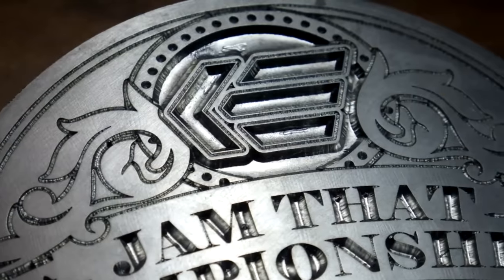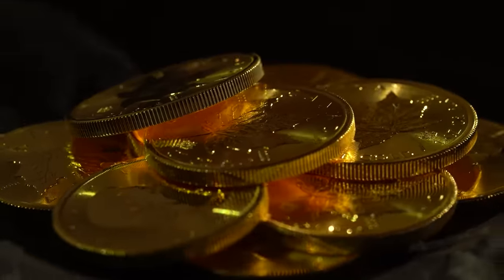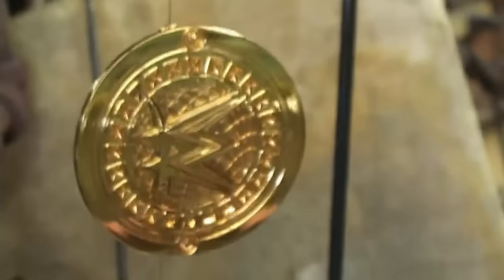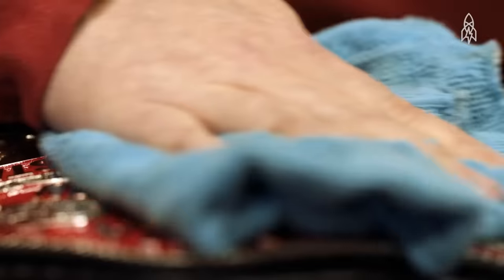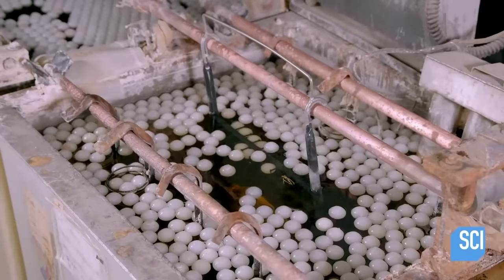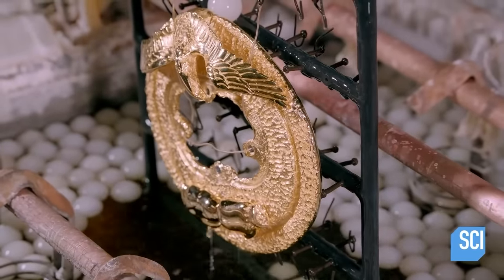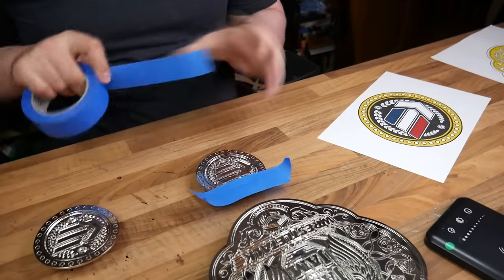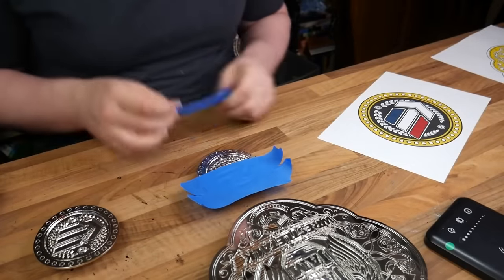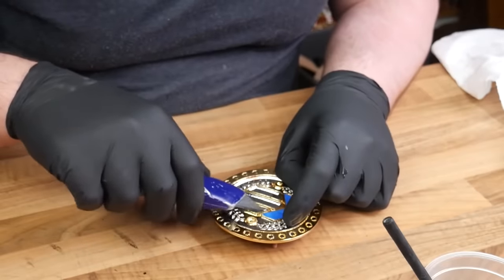Tin is a heavy and pretty corrosion-resistant metal, but it is no match for the looks, protective properties, and value of gold or other precious metals. This is why all wrestling belts are thoroughly electroplated with a layer of these metals. The tin plates are first thoroughly cleaned to remove any dirt or metal shavings, and then a rotating buffing wheel is used to hand-polish each surface. These are then allowed to sit in an electrolyte solution with a special chemical composition while being attached to a circuit that slowly deposits a perfect layer of gold or other metal onto the plates. For belts with more than one precious metal, the same process is done multiple times while covering separate parts of the tin to achieve a two-tone effect, and once finalized, the belt is as shiny as any piece of fine jewelry.